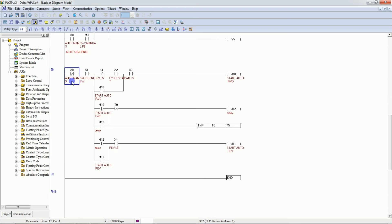Now let's look at the auto sequence ladder. If we are in auto mode, the selector switch is in auto, emergency is healthy, and the homing/reverse limit switch is actuated (pressed, giving a zero signal since it is NC) — meaning we are at the reverse/home position — and we press the cycle start push button, then M10 turns on and gets latched, and the stepper motor moves in the forward direction. Once it reaches the end position and the forward limit switch actuates, on the falling edge pulse (LDF), M10 turns off and M12 turns on and gets latched.